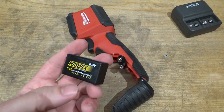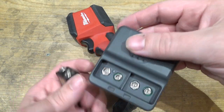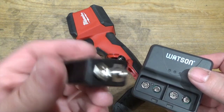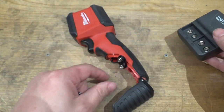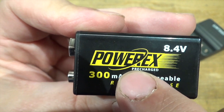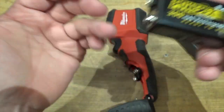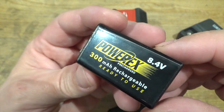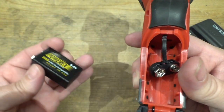That said, I do like the choice of using 9V batteries. I've got a little rechargeable nickel-metal hydride — get a handful of these and a smart charger. These are very useful because I have so many different instruments that use 9V batteries and only about three or four rechargeables, which is enough to swap from tool to tool. Make sure you get the low self-discharge models — basically they can sit in your toolbox for a year or more and still hold most of the charge.